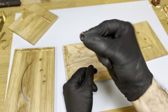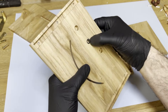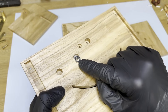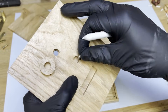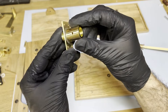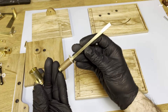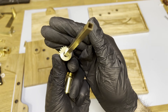The main box is made from American ash. I'm inserting the bearings into their housings, but unlike my usual builds, I'm fixing the box with screws instead of glue. That's because some components wouldn't fit if the box were permanently sealed. The first component is the bottom section of the gantry that holds the mop. It uses an oil-filled bearing that lets the square profile swivel, driven by a partial gear. This is screwed into the back section of the box.